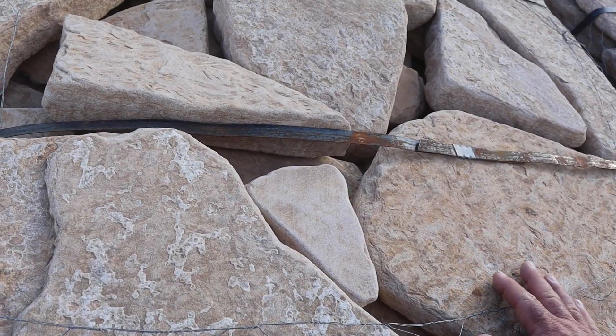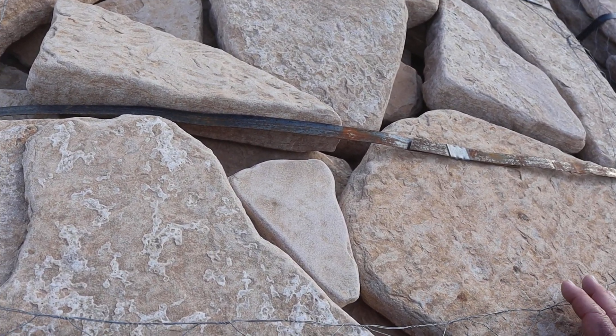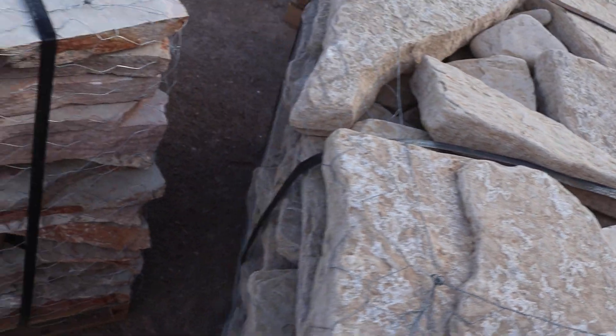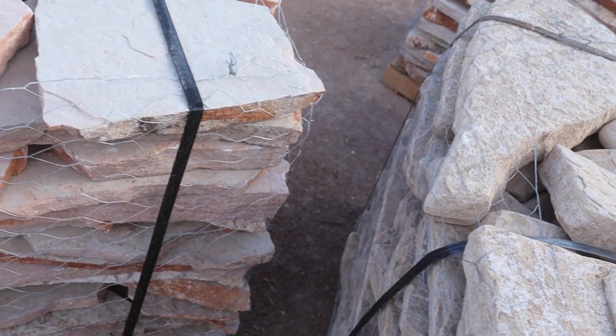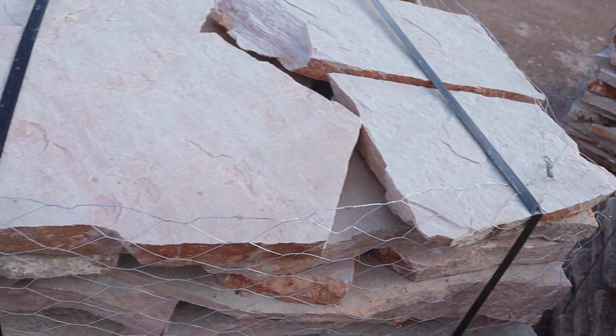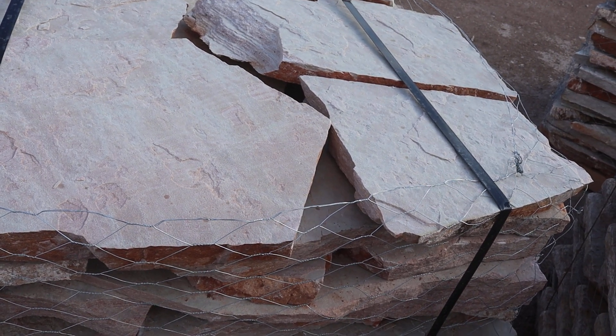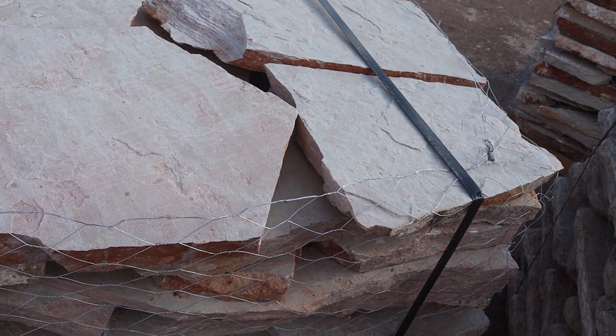This really needs to be fabricated at the quarry or by a fabricator. Regular stone tools will not work on this at all — not a chance. Whereas you can easily cut this with a cut-off saw using a stonemason blade.